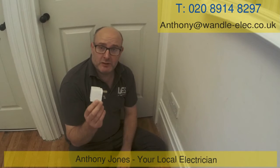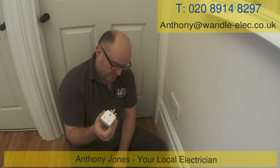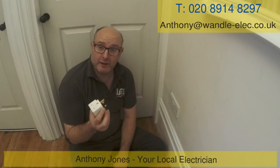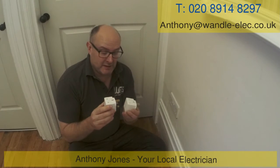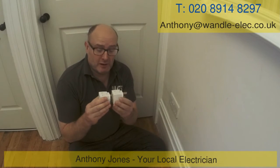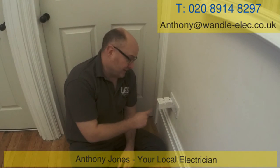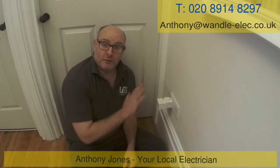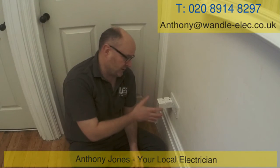I wouldn't recommend using these. I think if you need to use an extension lead, the bar type are much better. I'll show you one of those in a minute. But I do see these in a lot of places, and I quite commonly see this, and this is a massive no-no. One plugged into another, and then plugged in, and then 1, 2, 3 devices all off the one side of the plug socket. So potentially, 30 amps just going into that one socket on one side.